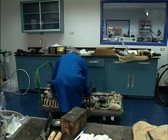Why is that? Well, you're putting on typically 25% more insulation. The mechanical protection is usually stronger than the original cable jacket and all the stress relief material that we applied in the joint. If it's done correctly, it should way outlive the cable.